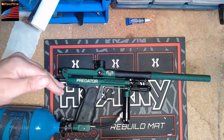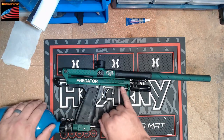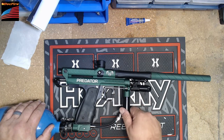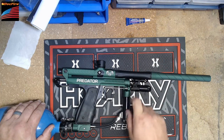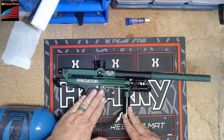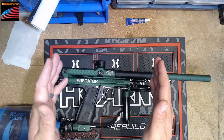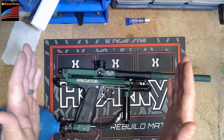So you'll find that if you raise that lug and you're firing and starting to get skip shots, you need to drop it back down. Then you would go back to this three-way collar and lengthen it a little bit so this doesn't activate as quick. So the hammer gets released first, then the three-way is activated, or the ram is actuated. That's what you want to do. Conservative timing means the hammer gets dropped first, and the space between when the hammer gets dropped and when the ram gets activated, that dwell time, the further apart that is, the more conservative it is.